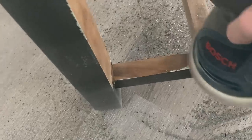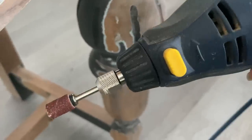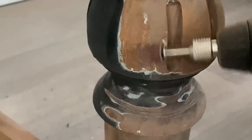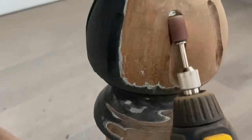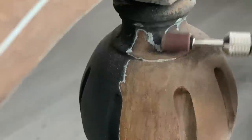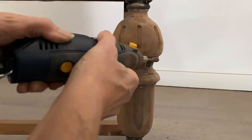Because chalk paint is a water-based paint, it actually sits on the surface of the wood — it's not something that sits deep in the wood. So removing any type of chalk paint is actually really easy and it doesn't harm the wood. It's a great way to upcycle and restyle furniture, and if you want to take it off, it's really easy. Oil-based paints and latex paints is a completely different conversation.